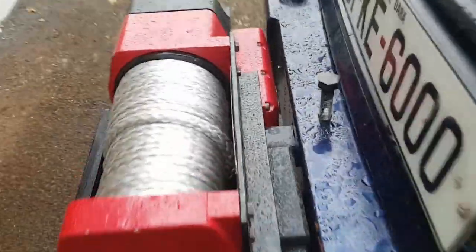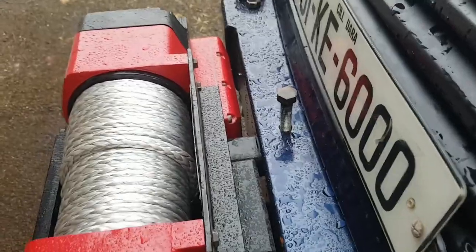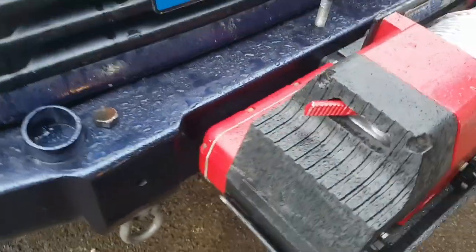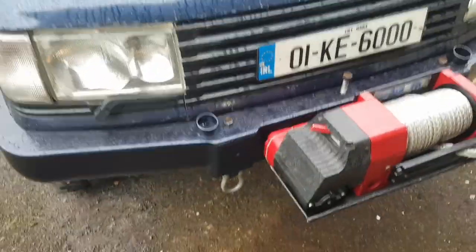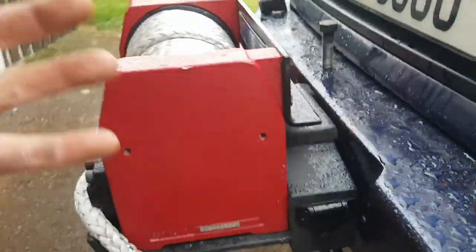It's attached via receiver hitch here with a pin. This tube is 50 by 50 by 5 box section with 5mm wall. The bumper is like 10 or 11mm, so yeah, I think it's gonna be strong enough to hold up. I added lots of metal to the plate — the plate is 8mm thick, and where the 50mm box joins it...